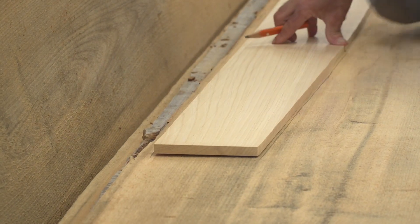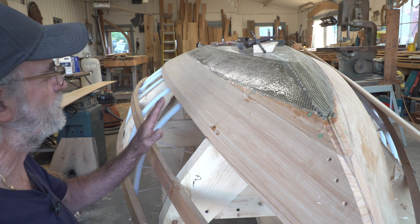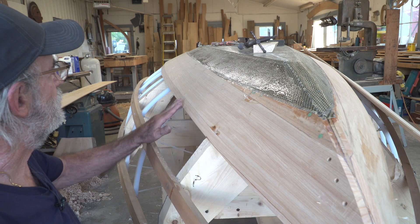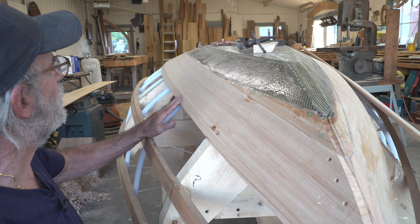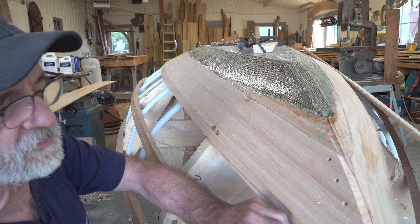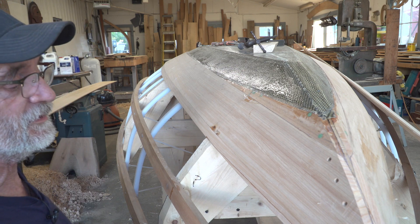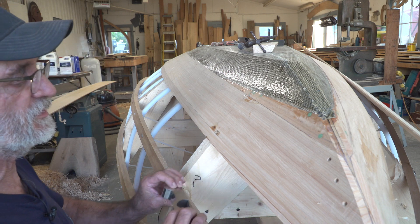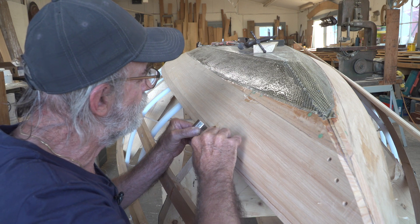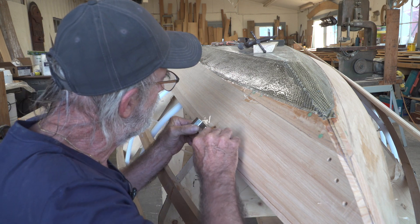Now I'm back on the boat doing a little bit of work on what they call the gain. The plank is all cut to shape and fitting really well. We've got an overlap of an inch and about a quarter inch of wood exposed past the broad strake, but as it goes forward it tapers right down flush at the stem. This is done with a rabbet plane — I'm putting it on the line I want to plane and using just one corner of the plane to dig a little tiny trench along that line.